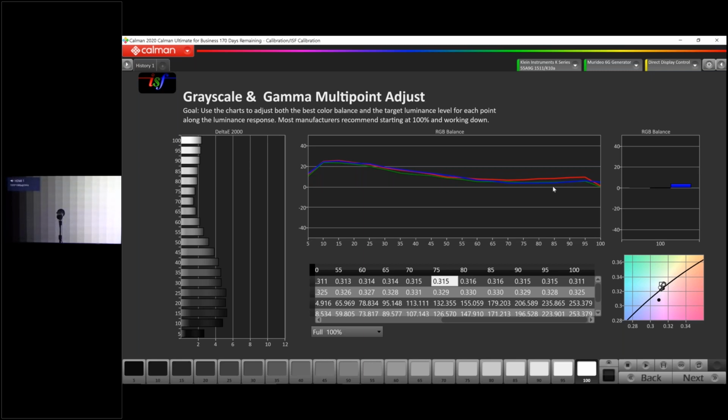And as I'm looking right now, it actually looks really, really good. I don't see any tint of any color. We're very, very neutral gray all the way through. No pink, no green, no yellow, no blue, no weird cyan colors or cyan bars. The darkest bar is basically black. It's actually really hard for me to see a difference between the bar and the bezel. There is some light in here, so I would expect to see those pretty easily. I have to really squint to see the bezel, so that's good.